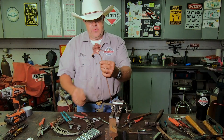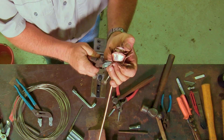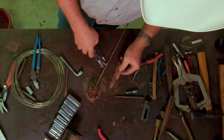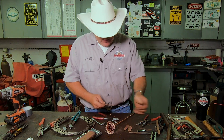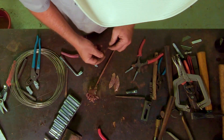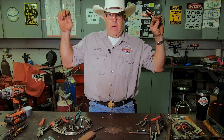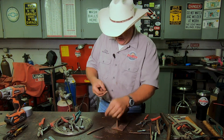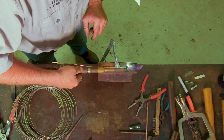We've got the rose. Now we need to do something with the sepals — if you've ever given a rose to a lady you realize these always curl underneath. Now we need to attach those leaves that we made. What I have for that is a piece of number 14 electrical wire — nothing fancy here at all — and we're just going to silver solder it. Big warning: be careful, you can melt a hole in this leaf really easily because it's very thin.